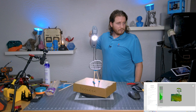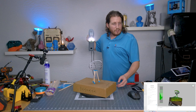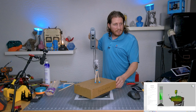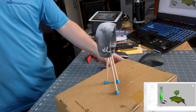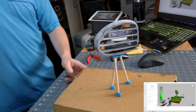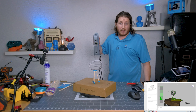Again, this scanner does not really have turntable mode — it's not supposed to — but we should be able to get somewhat decent geometry by going very, very slow. This is actually looking pretty good. One thing to note: this scanner does not capture surfaces and solids, so it will not produce a STEP file. That does require hardcore software like Geomagic or DesignX — and if you want to know how much that costs, the answer is you probably can't afford it.